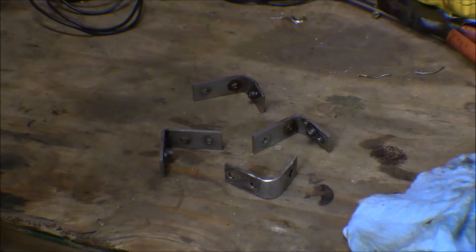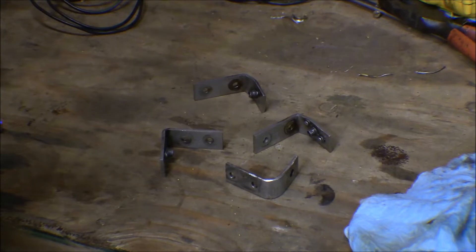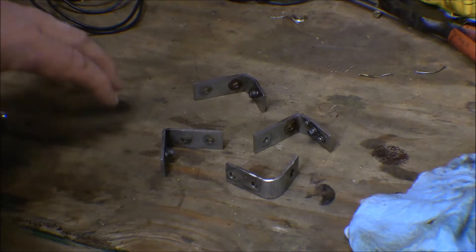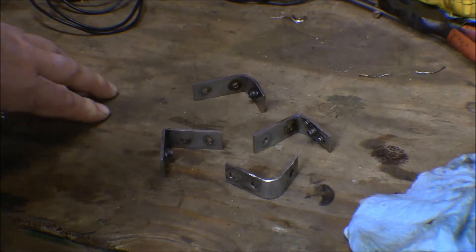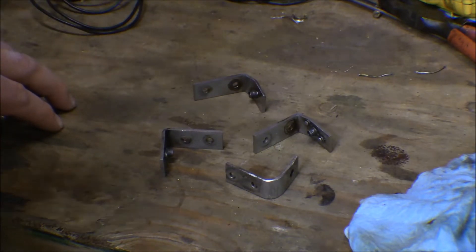One of the things I need to do before I mount the engine up is get these braces on the firewall for the engine cowling. I bought strips of stainless steel for that, and I made up the brackets that go on the inside of the firewall, on the fuselage side, that connect into the boot cowl. I was going to make up the brackets that fit on the outside of the firewall that the engine cowling fits on, but I got to thinking that maybe the ones on the existing firewall might work on the new one. The pattern is the same, the bolt pattern is the same — it all comes right off the blueprint.